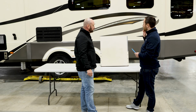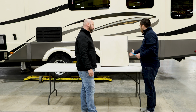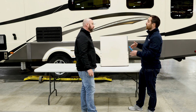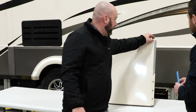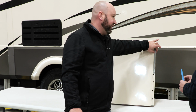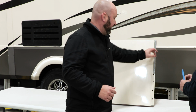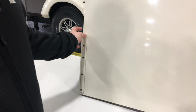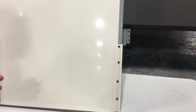Okay, and then the other factor. We solved an issue with the maintenance factor, because the mylar tape is a big benefit there. We don't have the maintenance like you would on the butyl putty, but there's also an issue with water that often happens with butyl putty as well. With your mylar, you have a plastic backing. The mylar will not dry out. We know that caulk and butyl will dry out. So mylar as our primary seal will not dry out. Butyl as your primary seal will dry out. So everybody puts caulk on the outside, and the idea is the caulk will eventually crack. You'll always want to maintain it.